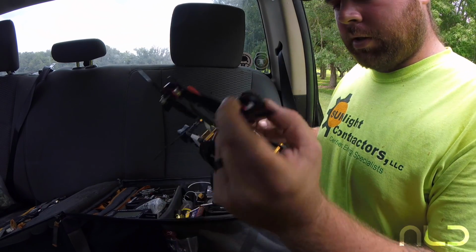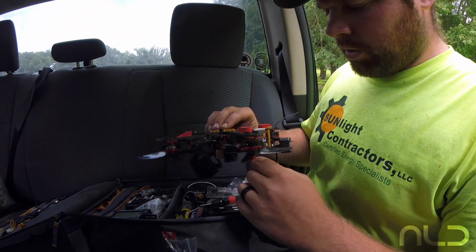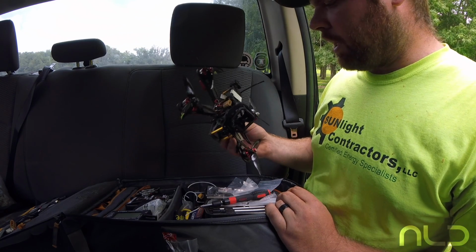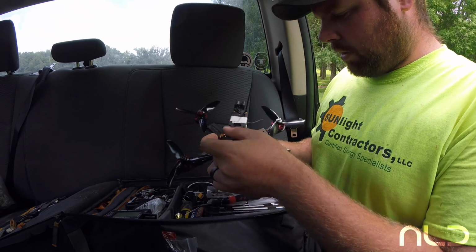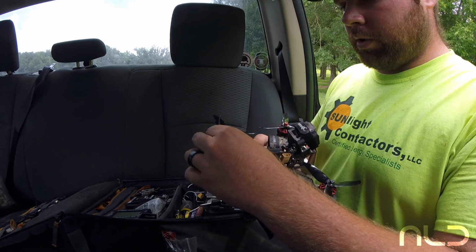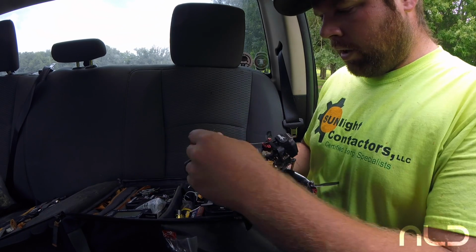Those are dead giveaways. I run TBS VTXs. It's a good thing to check and make sure that you haven't accidentally ripped out your pigtail. I've had that happen before. Get out 100 yards, go behind a tree and lose video completely because there's no antenna attached. Another big thing, this is more for the sketchy things, normally flying in the woods and stuff like what I'm about to do, it's not a big deal. If the quad fails safe, you just go pick it up.